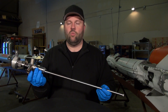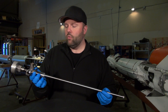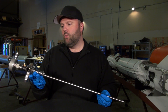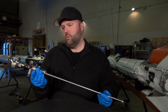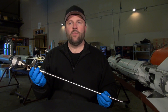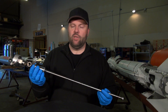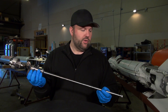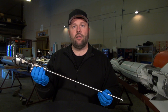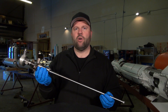We are going to install this assembly with the burst disk housing, the vent valve, the pressure sensor, the pressurization line, and finally a thermocouple to measure the temperature of the gas bubble above the liquid. This is a very intricate, nice little piece of engineering that's going to make a lot of difference from last year's slightly messy filling process.